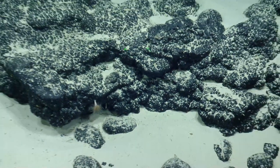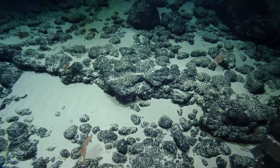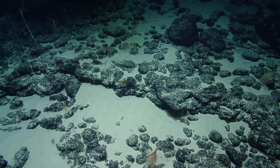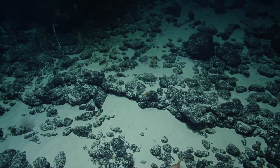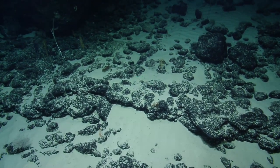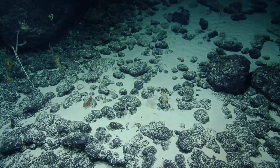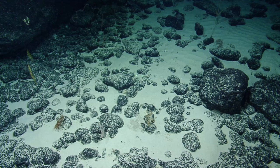So actually, I guess Jason always has to run the vertical thruster because they're light. All the ROVs are kept light, so they float to the surface if you lose them. So it always has to run a little bit of down thrust to keep on the bottom. But there are some ROVs that have variable ballast systems. If you had an all-electric vehicle with a variable ballast system, you could be neutral and be totally silent. So Alvin has variable ballast and can run silent.